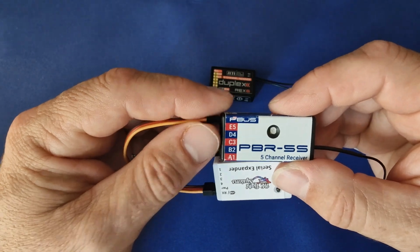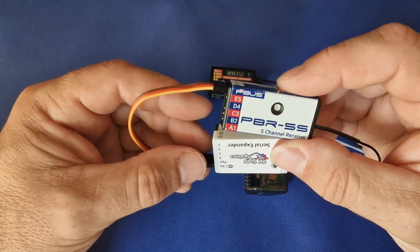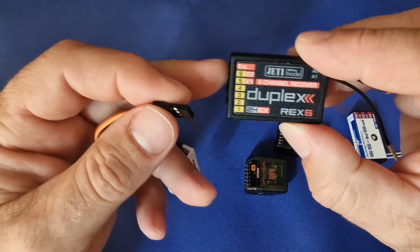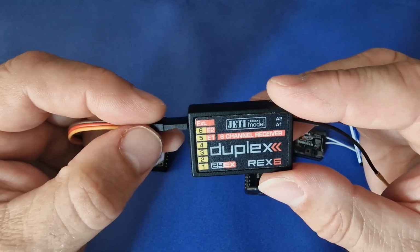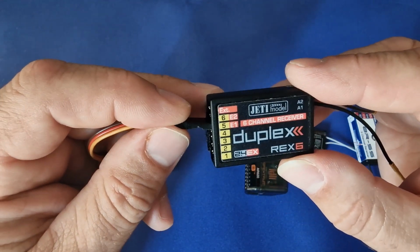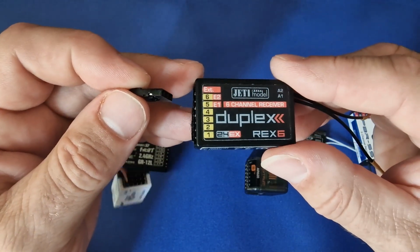You can directly set it using either the Jeti box application on the Jeti or just using the sensor menu on the Powerbox. Talking of Jeti, Jeti needs to be EX bus. So you've got E1, E2, so it's the E ports. It's not the EXT. EXT is a sensor bus only, so don't try and use that. It's either E1 or E2 or E3 in some of the larger receivers.